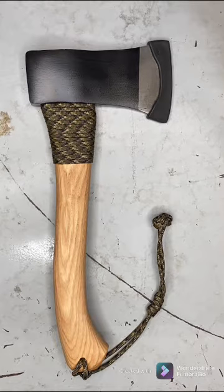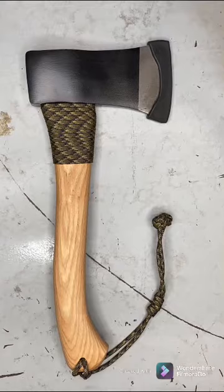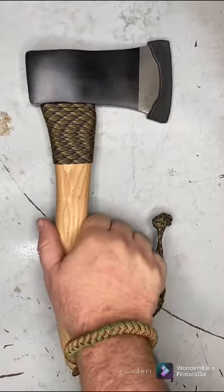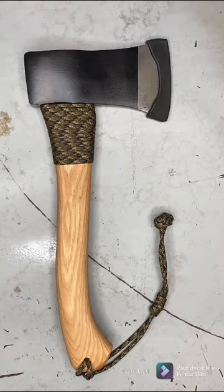Just do it in some light so you can see where it's still shiny. Then I drilled a hole in the handle and coated it with linseed oil — two coats. You rub on the boiled linseed oil and it dries pretty quickly. The handle now has a nice smooth grip — it looks better, looks like natural wood, it's not glossy, and you get a good grip on it. It feels silky smooth.